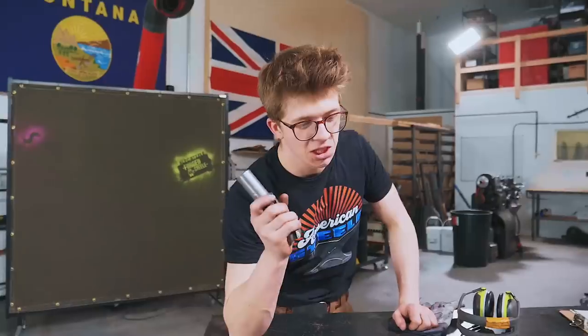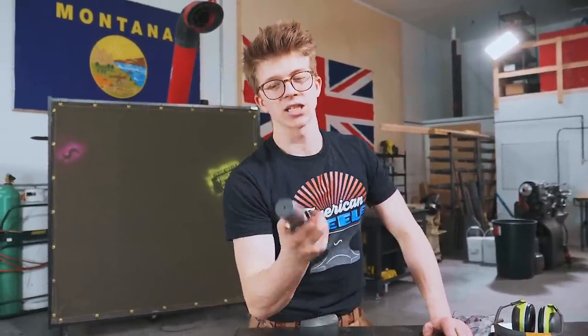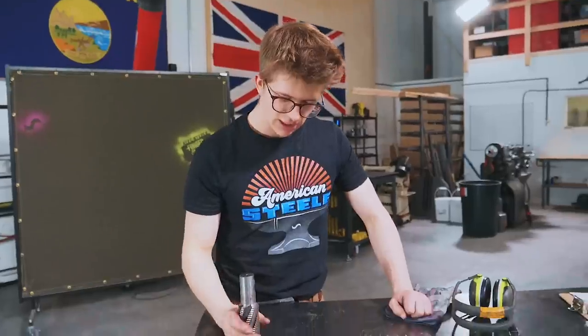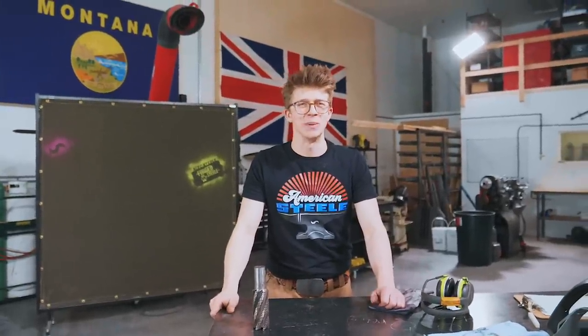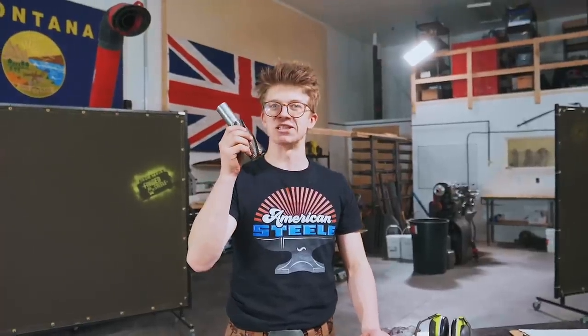So with the hook forged out of the high-speed steel, by the way, I'm definitely not gonna drill the holes to mount the hook. I'm gonna find another solution for that. I'm probably gonna weld on a little tab on the back and drill holes in that. But with the hook forged from the high-speed steel, it's now time to try the M42. There's lots more in this, and I tell you what I really wanna make out of this. I just wanna make a squished end mill so badly. So, provided this little forge, we're gonna give this a good squishing.